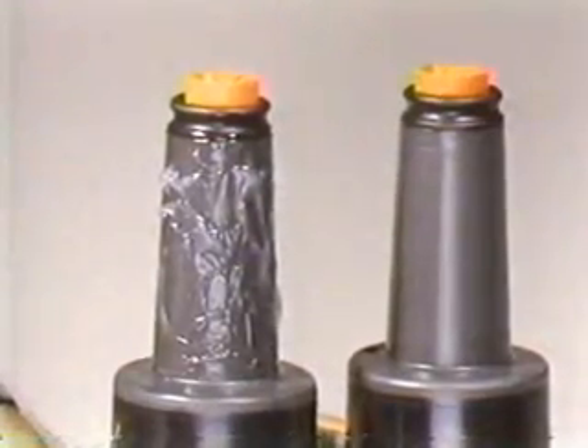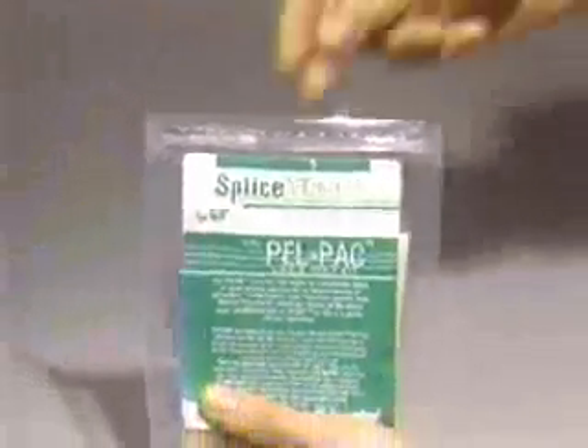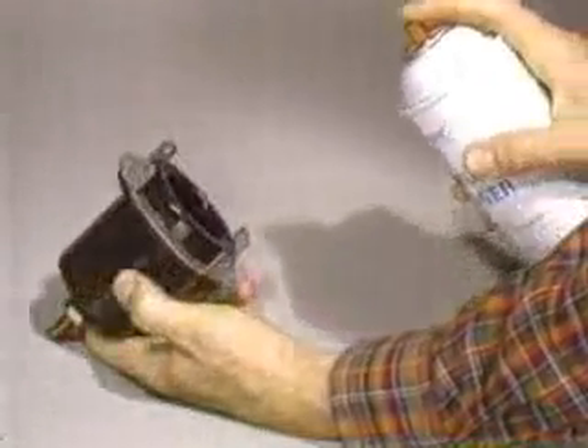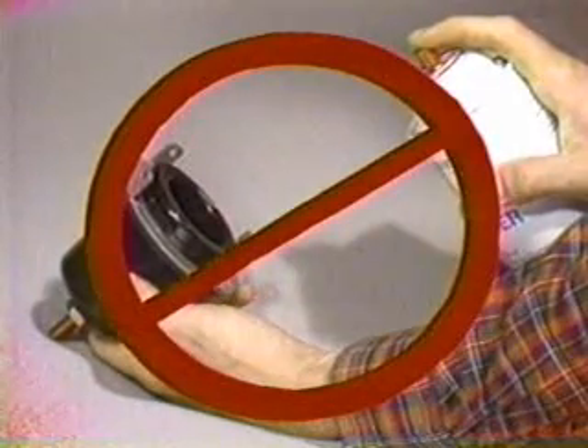Cable cleaning solvents can be used for a variety of other electrical cleaning jobs. One use is the removal of silicone grease from tools, parking bushings, or other components. The principles for this cleaning are similar to those for cable itself: avoid excess solvent and wipe the grease clean. As with cable, avoid spraying directly onto or into a component part. Too much solvent in a bushing well could affect the epoxy around the stud, causing oil leakage and failure.